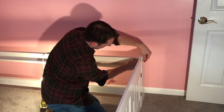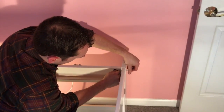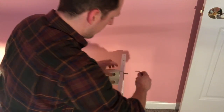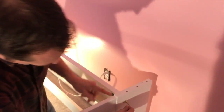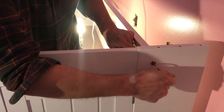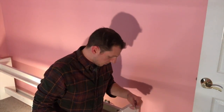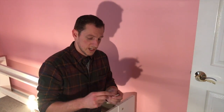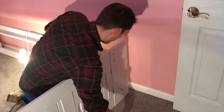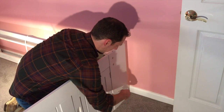And our nut H we're just going to put in. You can hand tighten it a little, then use your Allen key to tighten the rest of the way. For the bottom support, use B, which has a point on it — so this is just a big screw. Line up your peg and just tighten with your Allen key.